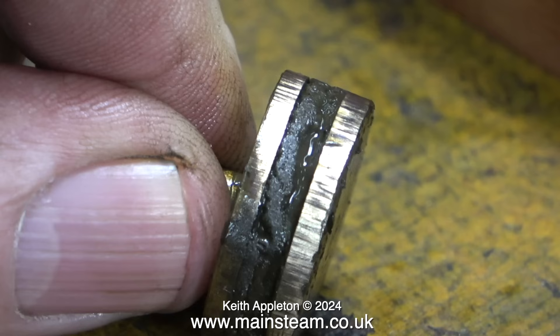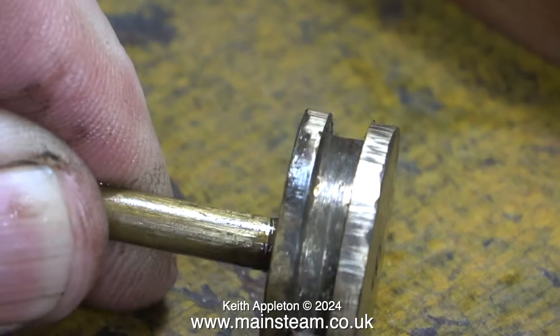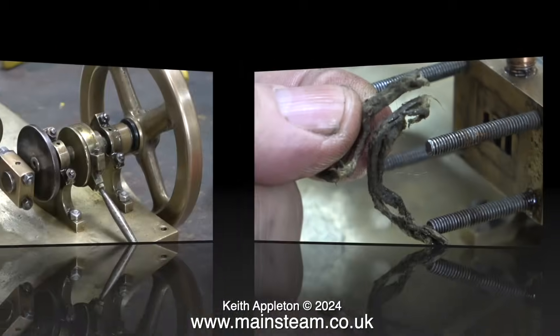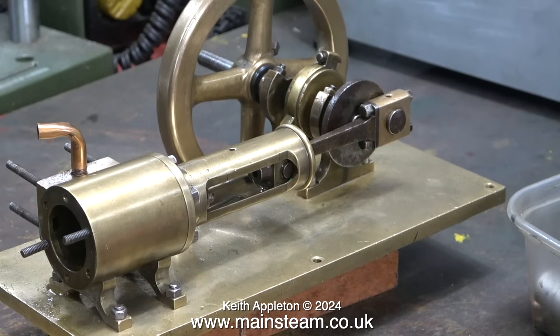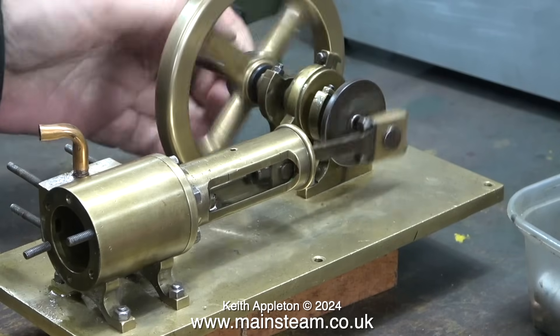The owner sent me the engine because there's a boiler with it, but it's made from steel so I don't want to work on that. He only runs it on compressed air now. A small pot boiler supplying low-pressure saturated steam would probably supply sufficient lubrication as the water becomes the lubricant, but running on compressed air the engine only gets air. The bearings need adjusting, the port face, slide valve and operating rod need attention, the piston needs repacking, the glands need repacking on both piston rod and valve rod, and I need to make gaskets for the steam chest cover and both cylinder covers.